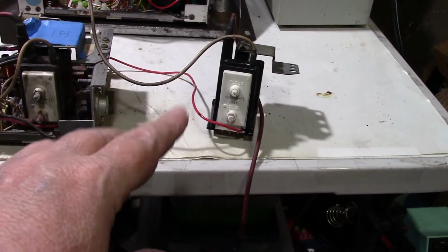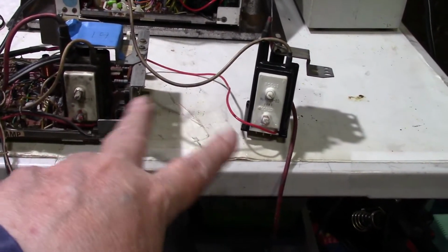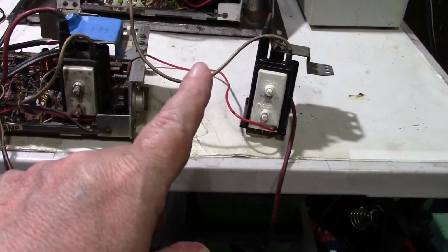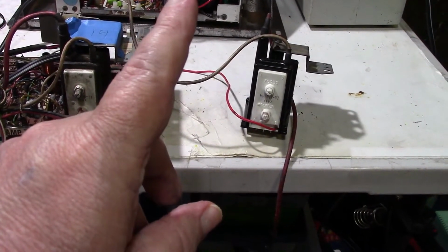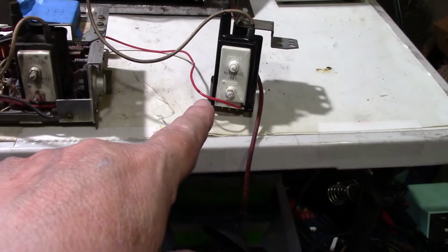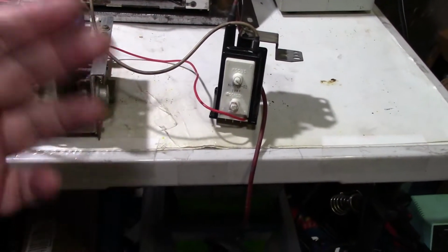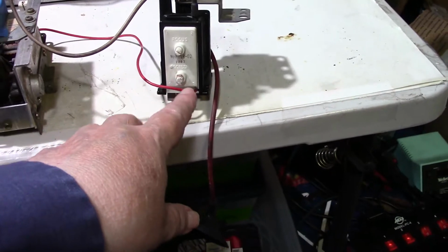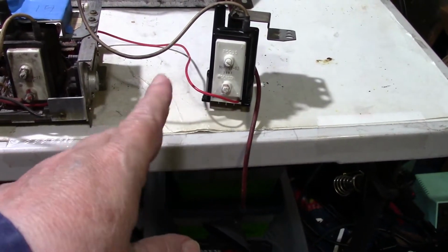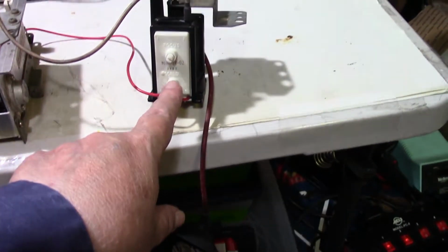Even though it looks the same on the schematic, and the same voltages feed both Flyback transformers, it's got the same exact voltages, but it doesn't tell you what the anode voltage should be, and nowhere on there does it tell you what the screen voltage should be. But I should think the screen voltage would be adjustable within a certain amount. From what I've been reading, a lot of screen voltages can be all over the place. It can be anywhere from 400 volts DC to 800 volts or even higher. So I'm going to have to be careful measuring the screen voltage because my meter only goes up to 600 volts.